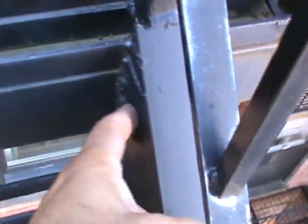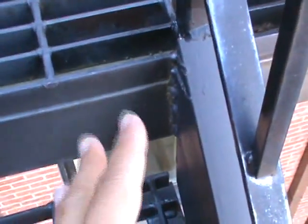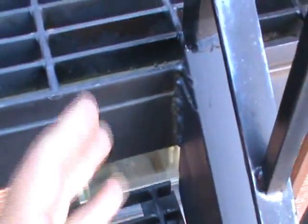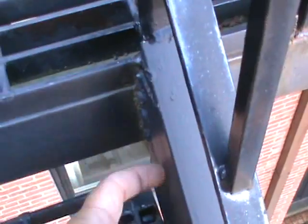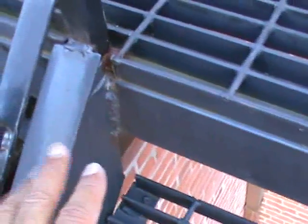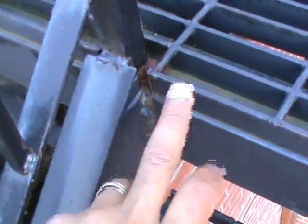Otherwise, I can give an opinion on this weld, say that I feel it's in good order, but I need to disclaim any liability associated with it because I don't have x-ray right now. I don't want that liability, but I will. But as soon as you put a clip on here and you bolt it on both sides, there's no liability for anyone because we certified it in lieu of a load test. Otherwise, x-ray or load test is what I want on any of these welds for me to sign off on.